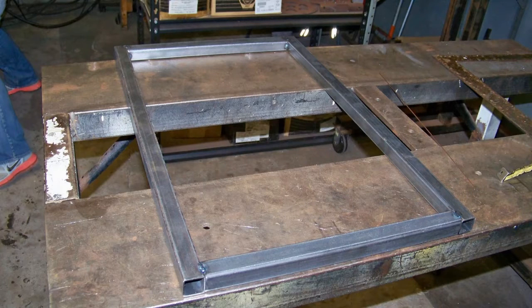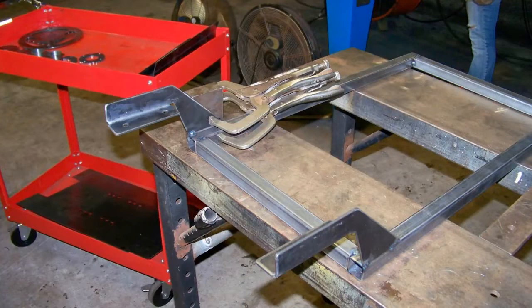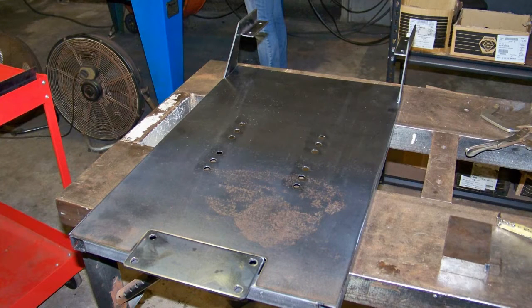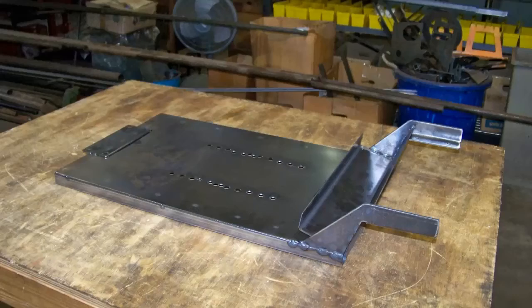For the chassis, we have cut and welded a frame out of 1-inch steel square tubing. The motor mounts shown here being clamped for welding are made from 1/8th inch steel sheet. Both motor mounts have been welded to the frame. The floorboard and front uncoupler have both been plasma-cut and welded. The battery holder has been formed and welded onto the chassis.